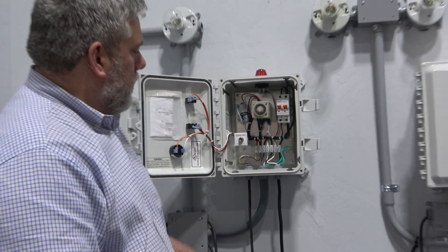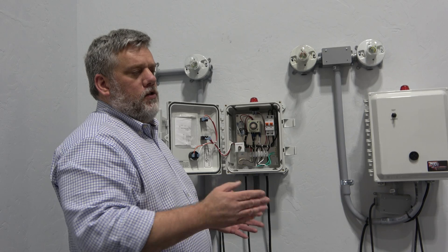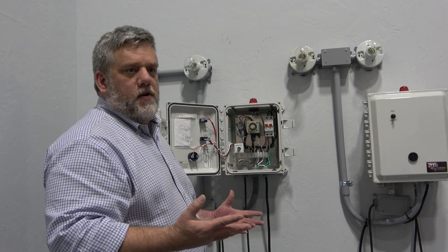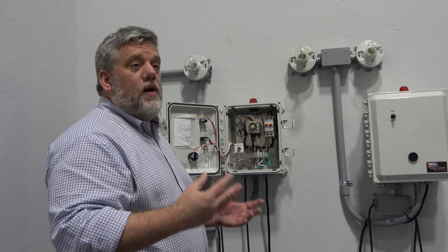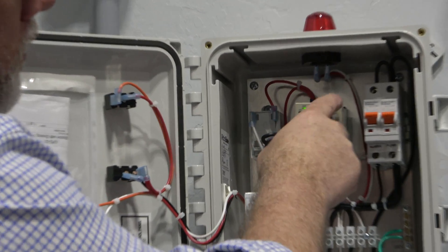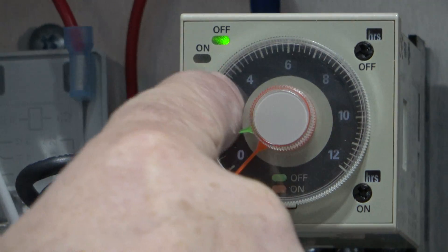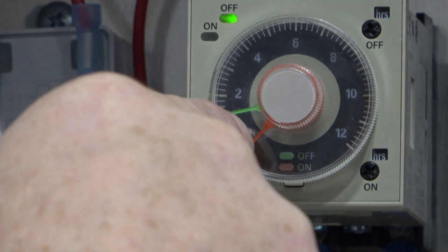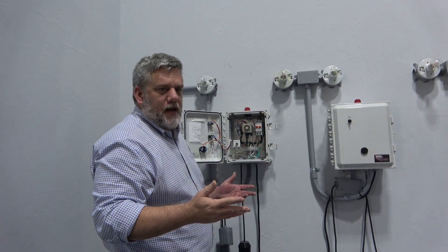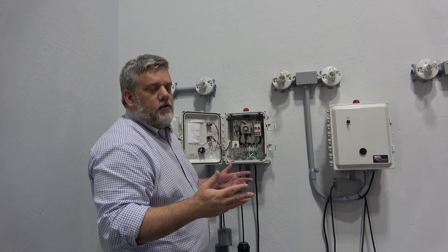This is a 120 volt panel. The dosing timer works like this: let's say you have a half horsepower pump and on your performance curve it does 100 gallons per minute. If it pumps five times that's 500 gallons — but you don't want it to pump that much, you need it to pump 25 gallons each time. So you set your timer — you can set it for minutes, seconds, all kinds of combinations. You might say 'I want it to run 25 seconds every two hours,' and with this screw here you can adjust those numbers to dial it in.